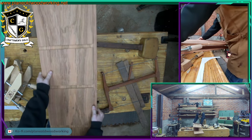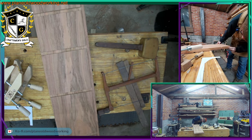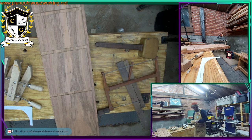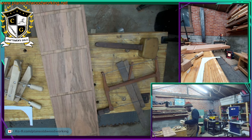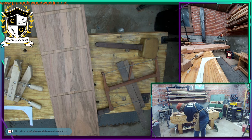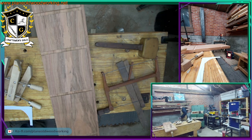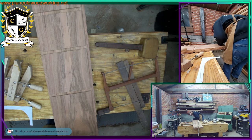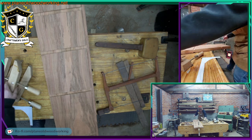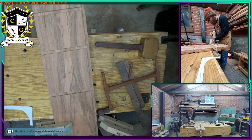The dados are here, and then we reclamp again. Okay, small wooden clamp. And like I said, the wooden clamps are strictly because these do not leave deformation marks. Or if you can get deformation marks out of them, I guess is the actual truth. If you can get a deformation mark out of them, you're squeezing way too hard with these things and probably about to break them. Because you're probably going to be close on the verge of breaking them if you're squeezing that hard.